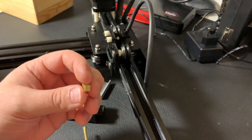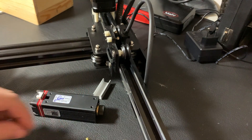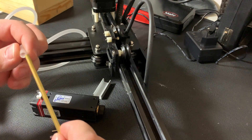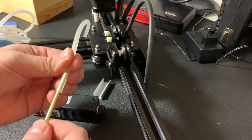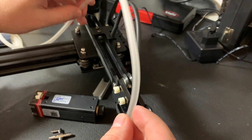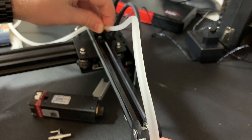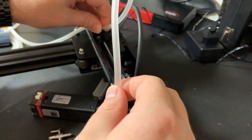As a nozzle I will use this piece of brass - I will make a nozzle out of this. To connect the pipe to the air compressor I will use just a regular aquarium pipe. This connects to this one, and I am pretty sure that this connection will be enough. So this pipe will go from here to here, and the actual length of pipe I will discover a bit later. It will be enough to move the laser and the pipe will not touch anything.